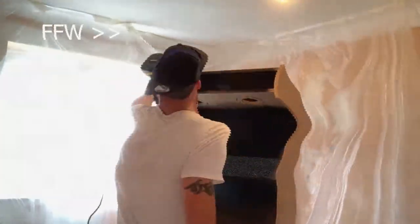Now, after the arcade cabinet was built, I actually sprayed it with a water-based multi-surface paint. This helped me save time as I didn't have to apply a primer or undercoat. The external sides of the arcade machine were always going to be covered in vinyl, so I didn't want to spend too much time actually spraying the machine.